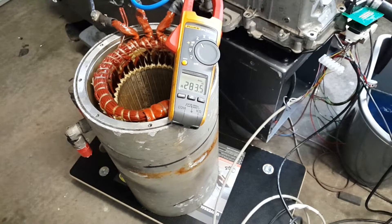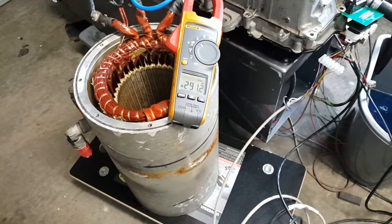Everything is starting to shake over here — the magnetic fields in here would be pretty crazy. Just pushing over 300 amps now. My cables are going to start melting soon. There's 300 amps being maintained into that motor stator. Let's go to our spot values — I'm just waiting for the bang. I've got a finger in one ear. My current sensors are definitely working — telling me 456 peak amps right now, which is about right. Our heatsink is at 43.7 degrees centigrade. If we can believe that — I'm sure the internet won't.